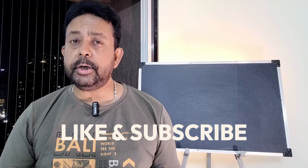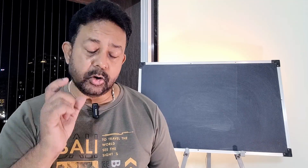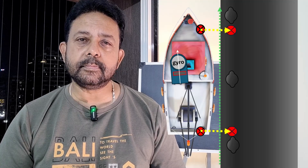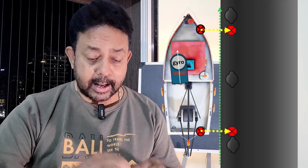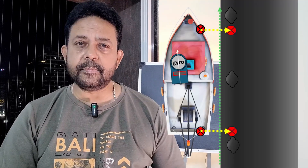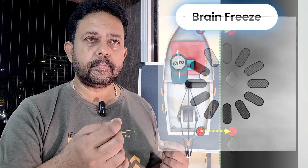You actually do not need to shoot the GNSS antenna on board the vessel — you can set up your DGNSS antenna very close to the vessel's GNSS antenna and then do the simultaneous observation to find the C-O. Next, a quicker way: find the jetty alignment from the chart or from any historical data. Set up two reflective boards along the alignment of the jetty near the bow and stern of the vessel. Then from the vessel using a laser distometer, take the distance from two offset points that are perpendicular and parallel to the vessel's fore and aft line, and that way you can find the horizontal distance.